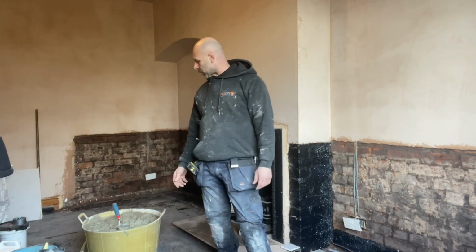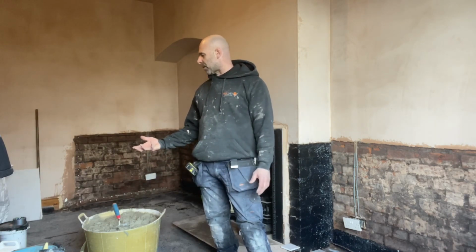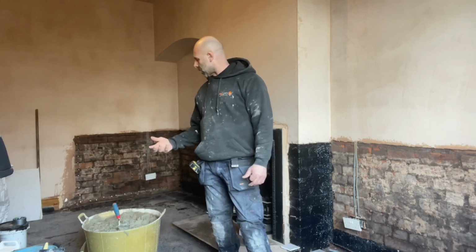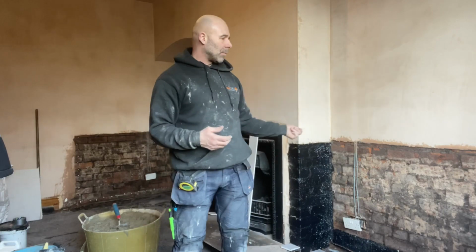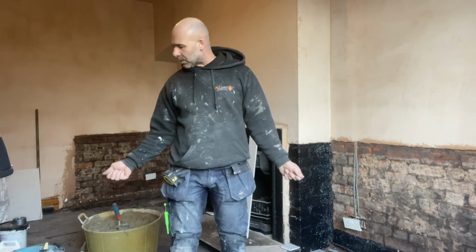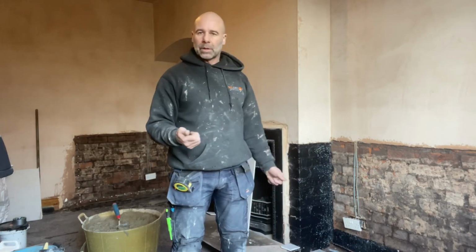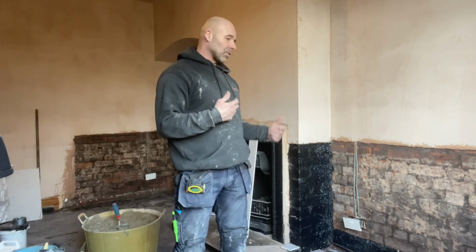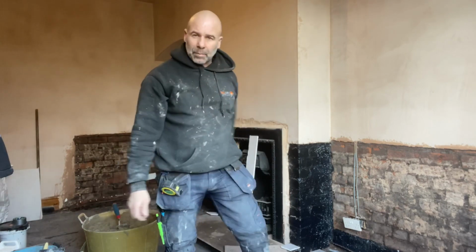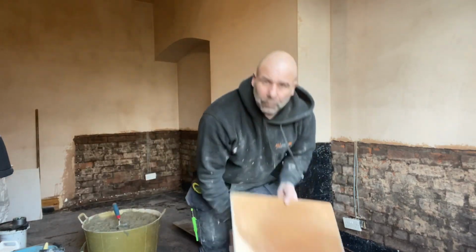So we've put a fair bit in, but not that much. And then we've damped the walls down, and we've put SBR in the damping down mixture as well. And I'm just going to rattle it on now, so I'm giving it 5 minutes so you can watch me. See you for a treat.